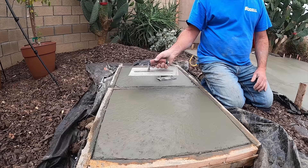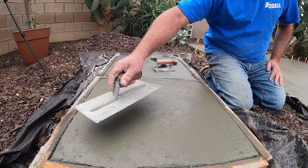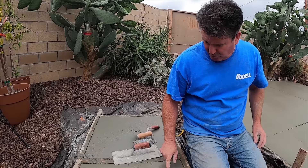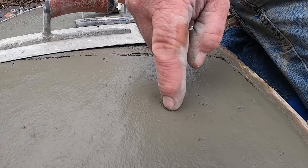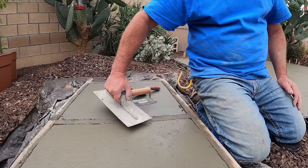The cream's not really popping off the glass beads as much as earlier because it's a little drier now. Once we get a perfectly smooth finish, you can see those beads starting to pop — there's the glass. What's happening is it's still a little wet for your final trowel, so the cream is just kind of rolling off the top when you pass the trowel over it. Basically it's just too wet.